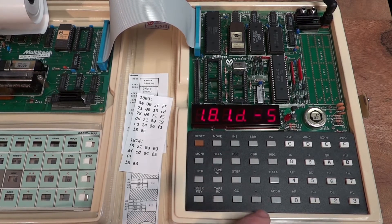If I jump to the beginning of the program at 1800 instead of 1802, then the program starts with loading zero into the accumulator. The relative jump address computed is E1. If we execute that, you would expect the accumulator does not change its value because it's always reset by loading zero into it — and there you go, that's exactly what happens.